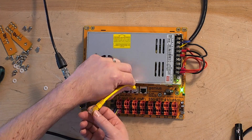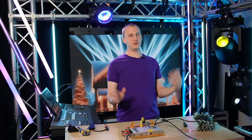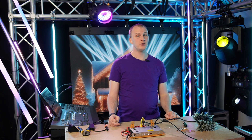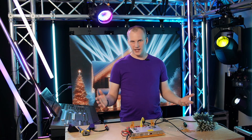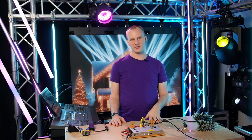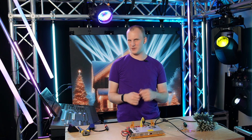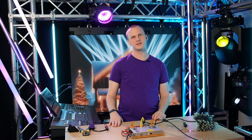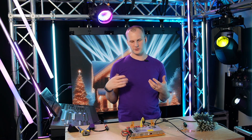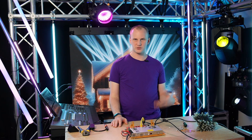You hook it up, plug in your DMX, send it off to your light, and you're good to go. However, in holiday light shows — and I've noticed this in my own — you basically end up running hundreds of feet of DMX to get from wherever your controller sits. In addition, some controllers make you strip a DMX wire and put in terminal blocks. That can be fine, but it's kind of annoying, and terminal blocks can drift or loosen between seasons with hot and cold cycles.